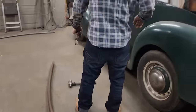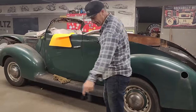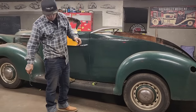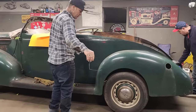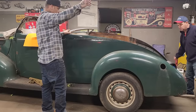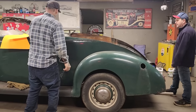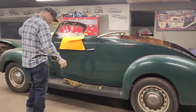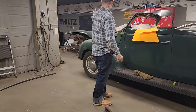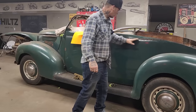So in order to make something roll that out, I'm not quite sure how you would do that unless you've done that manually. I'm not sure. But it is eighth wall thick. It is very thick, and it's hard to work with. But me and Doug have mastered it. You've seen us build the Bugatti hauler. We did it all with that square stock. That's quite thick stuff. But we did it. So now that we have the roof skin, I'm stepping on my new boots. Now that we have the roof skin over there and just a sheet of metal, we put it on there once before. I've got this butt welded on here.